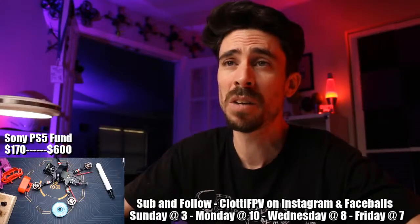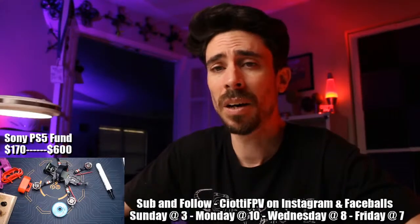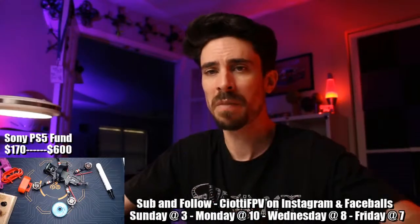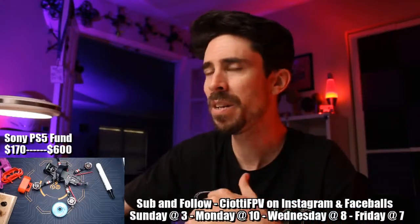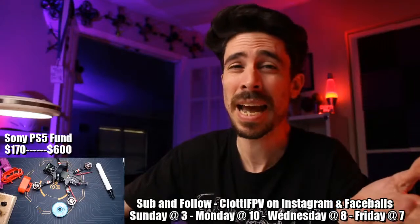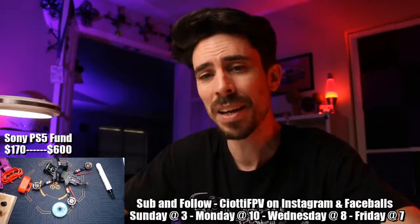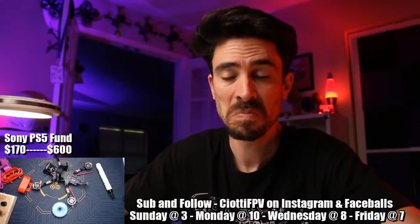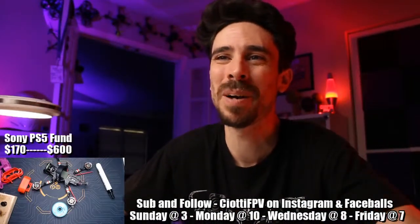If the Thumb is not good enough quality, the problem with the RunCam Hybrid is you get props in view on most frames. The AOS 3.5 is probably the only frame where you're not going to have that situation, but we're not talking about that frame. So yeah, Insta360 GO 2 is another big step up, phenomenal quality. And then you're going to go all the way up to the DJI Action 2. So I think the Insta360 GO 2 is what you want. Make sure that your motors are not super notchy, super coggy. That will cause jello. And yeah, other than that, get a better HD cam and prosper.